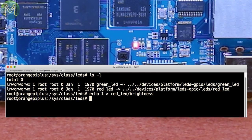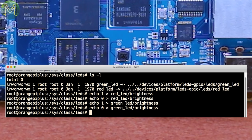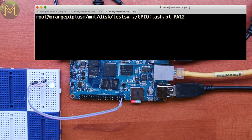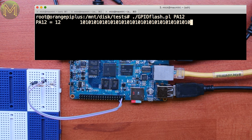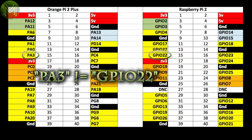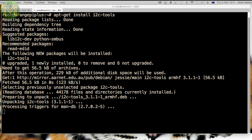You also have access to the onboard green and red LEDs. If you watched my Orange Pi Zero review, you would have noticed the plethora of GPIOs available on the H2 Allwinner — the H3 is pretty much the same. Shame the company didn't push out more of these. Basic GPIO access works without issue; however, you have to be careful how the pins are named. My script, which is available on GitHub, translates Orange Pi GPIO names to /sys pin numbers. This seems to have become a real issue with SBCs these days, as the GPIO names are very different to those on the Pi.